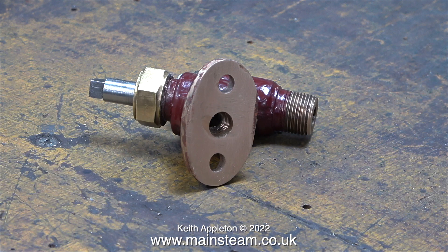The final conversation took place with David English, who asked me where the check valves were on the boiler. As David and I were having this conversation, suddenly the penny dropped. The water rushing into the boiler is cooling the steam because the position of the check valves on this boiler are a bit high, and as the cold water rushes into the steam space it condenses the steam. This condensate gets carried down the pipe which feeds the injector with steam, and the injector knocks off.